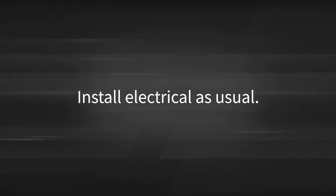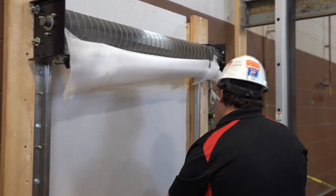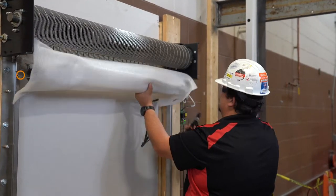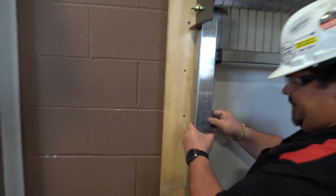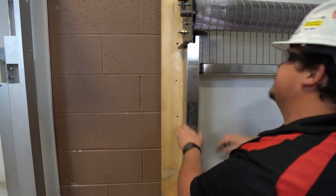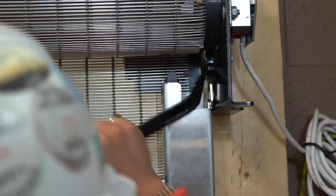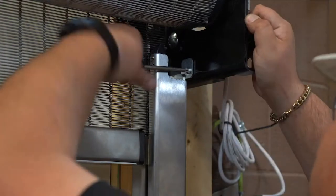It is now time to hook up the electrical for the tube motor as usual. You will now snip the metal banding to release the curtain. You want to start by ensuring that the bottom bar bearing is inside of the fascia side guide flange. Next, you will raise the coil side guide approximately one and one quarter inch higher than the already installed fascia side guide to align the key slots with the slip fit fasteners. Then you will push the coil side guide into the fascia side guide and tap down until the guides are flush at the bottom and slip fit is snug. Lastly, you will secure the guide in place with the top fastener to bracket.